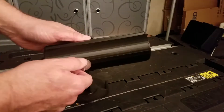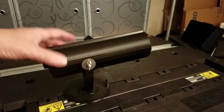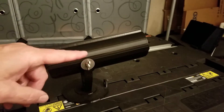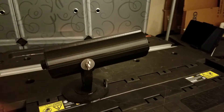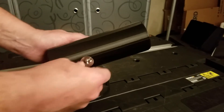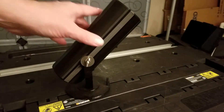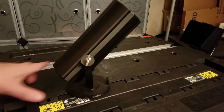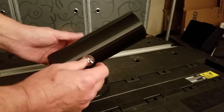The hardware for the stand — I did use wing nuts and a washer, a fender washer, so that it's easy to put in place. Just enough pressure that it stops it from moving without putting so much pressure that you're going to crack the PLA. The best thing about this, with a flashlight in the back, is it defaults back-heavy instead of front-heavy. So it's never going to droop during the day. It's always going to lean back, which is good because it wants to be focused up anyway.